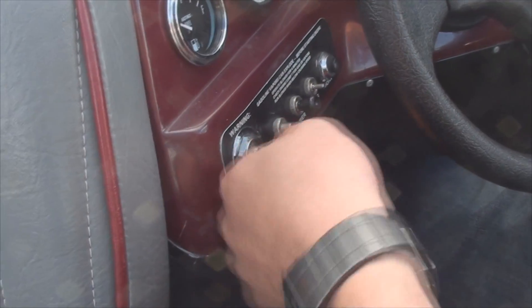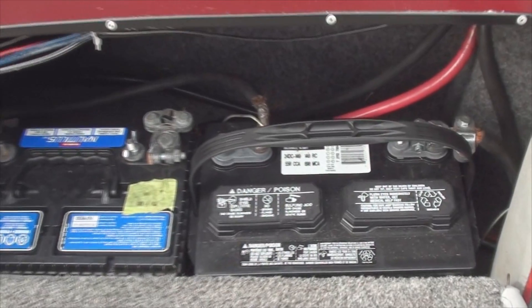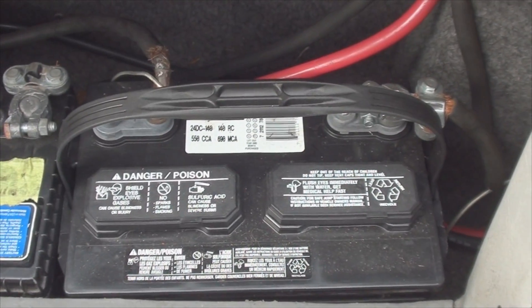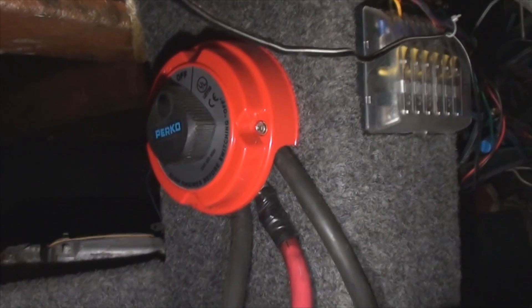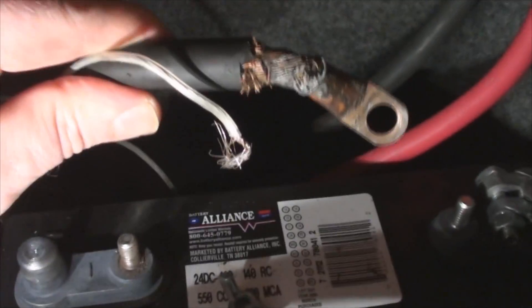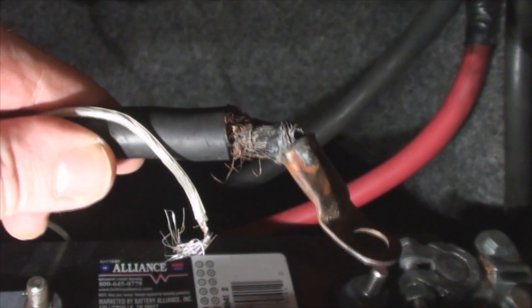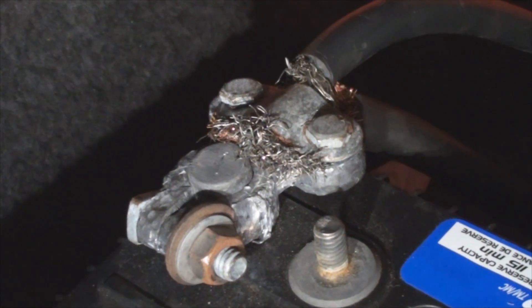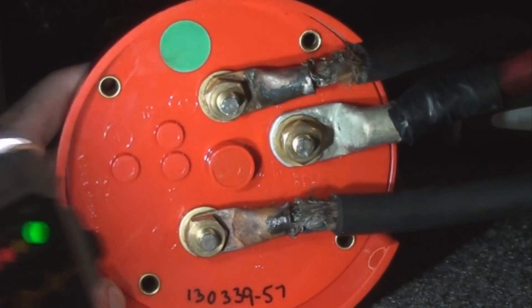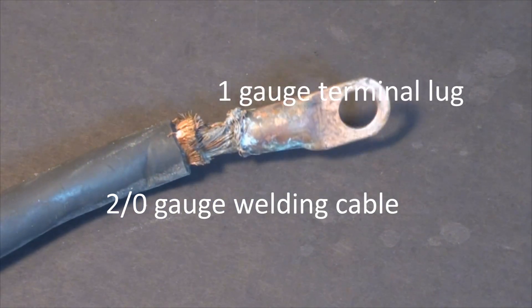I find a lot of people are prepared to blame their battery when their machines won't start, but often it's just another symptom of a much bigger problem. If you see mismatched cables, broken and or corroded connections, temporary terminal clamps used permanently, wrong sized terminal connections, wire cut down to fit — it's time to make new cables.